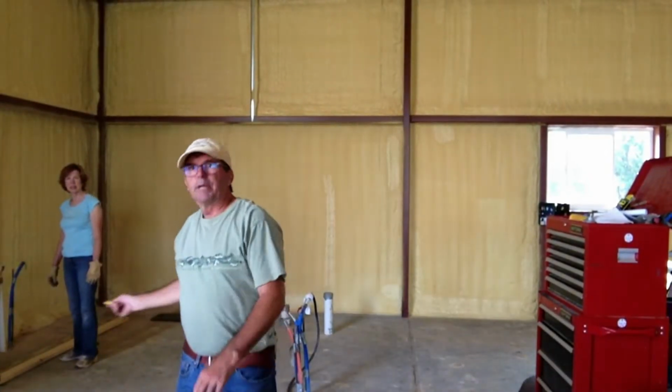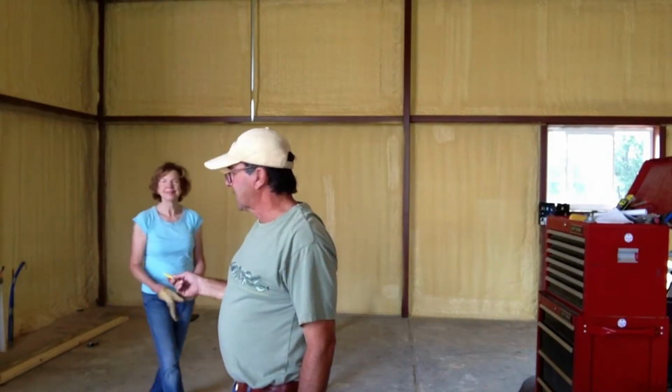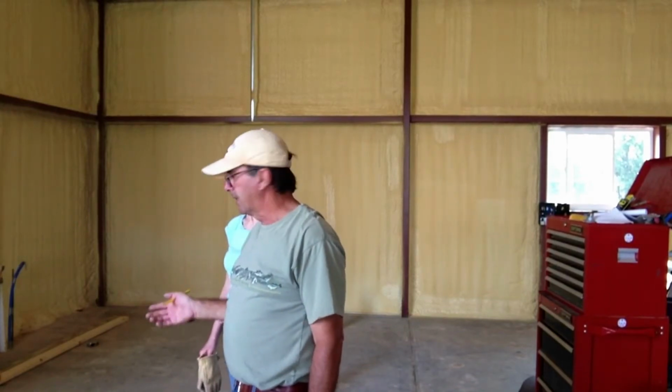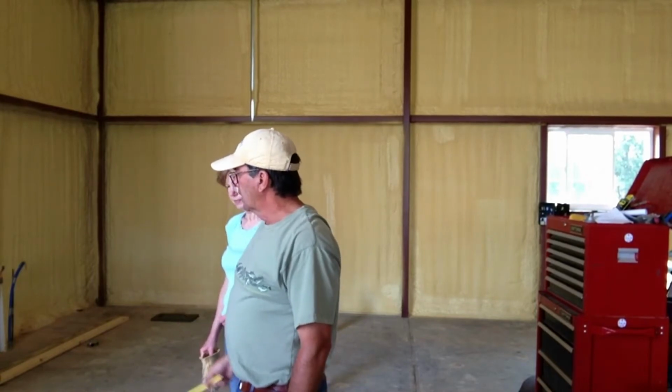So what I'm doing here is laying the plate out, marking 16 inches on center, and then I'm just putting it next to the right side of it. So that's where my 2x4 will go when I leave these 2x4s on edge. We'll put our 8-footers. Another thing you want to think about when you're doing a plate on the bottom and two plates on top, that's 4.5 inches.